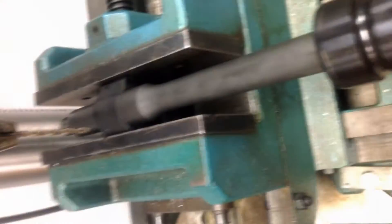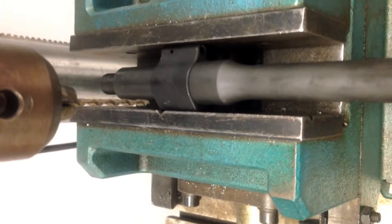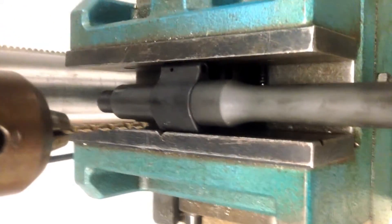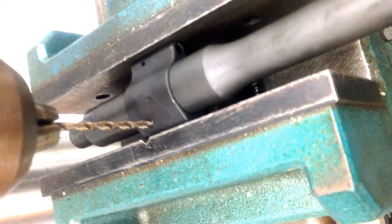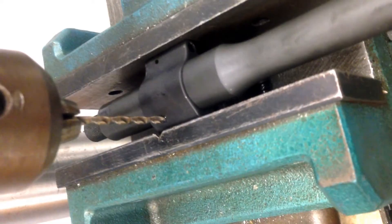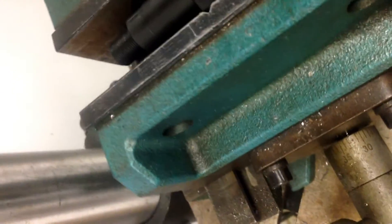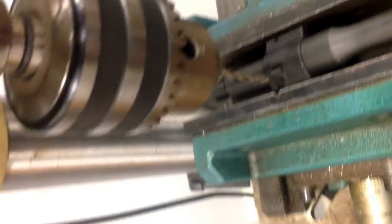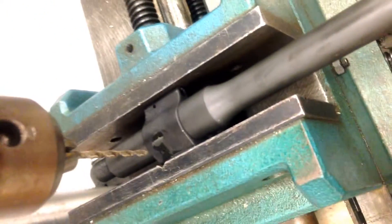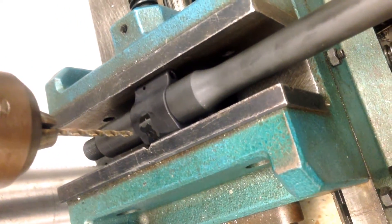Now that we've got our gas block aligned and tightened down with the set screw, I've got it locked in the vise on my drill press with the bit included with the 87 Industries pin block kit. Before I turn the drill on, I'm just making sure that when I touch that flat I don't see any movement on the bit — I'm not side loading it and it's going to go straight through. Put on a little bit of cutting fluid and start cutting metal. It seems scary with all the money in your barrel, but with a design like this it's actually pretty easy to do.